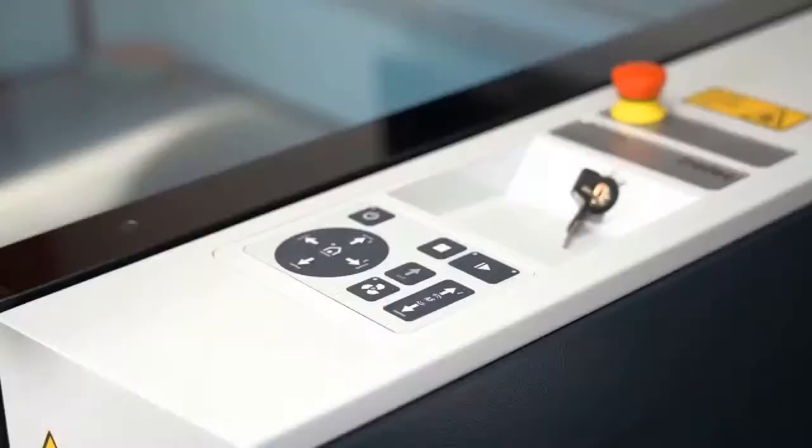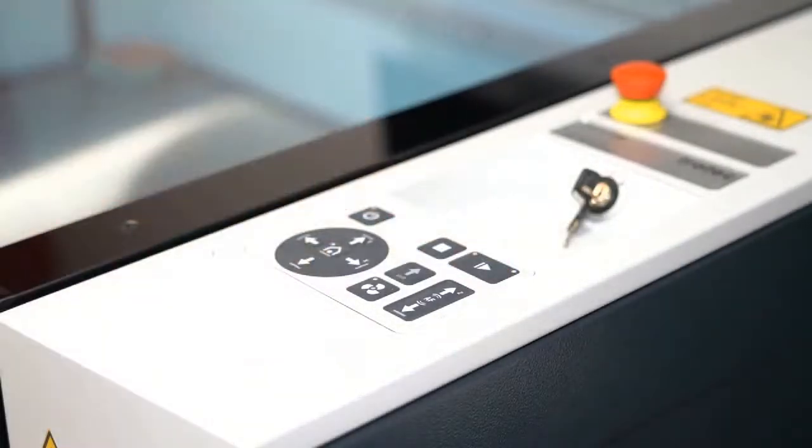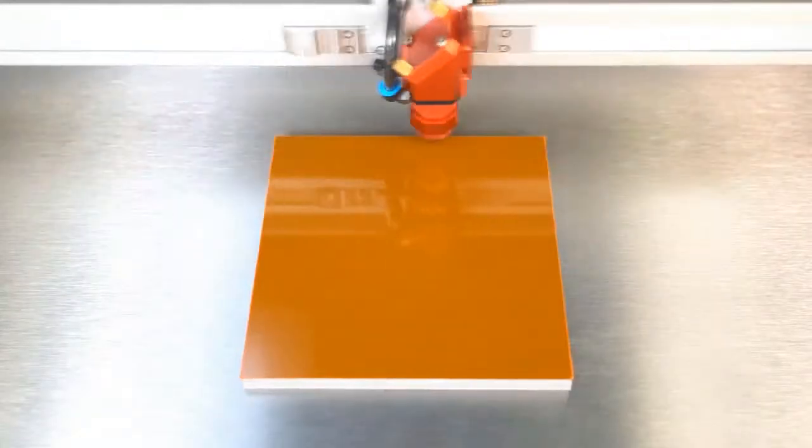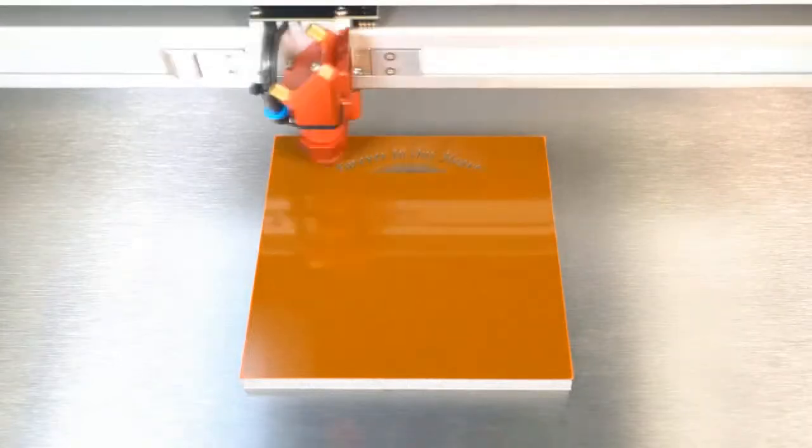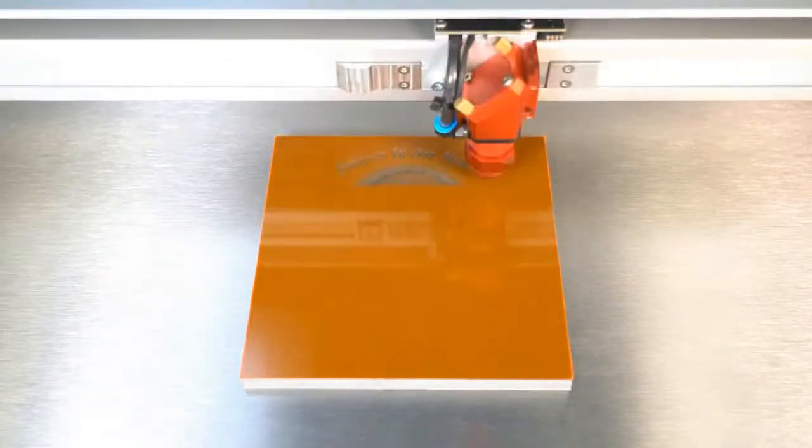So we're focusing onto the surface of the material, starting the laser system. And instead of etching on a radius or anything like that, we are literally etching through the Blazer orange laser mask, and we are etching slightly into the granite itself. Now, as I said before, we cannot produce depth into granite. You can lightly etch away the surface, which gives us contrast, but there's no discernible depth into the surface of it. So this process goes through the mask, and then it engraves.